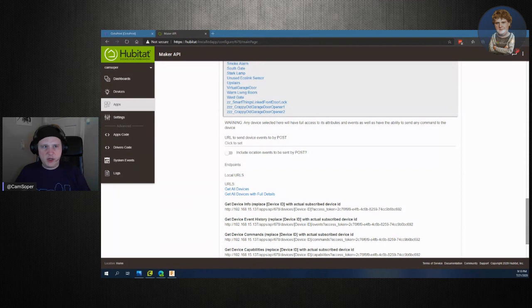if you wanted to upgrade or replace your hub, that's a problem, because with Z-Wave and Zigbee, the devices are tied to the hardware, not to the software. So you can back up the device configuration all you want, but you can't restore it and expect it to work, because all those device pairings and hashes and everything are tied to the hardware. So they were working on a plan, because the C5 was the first one that didn't have a radio.